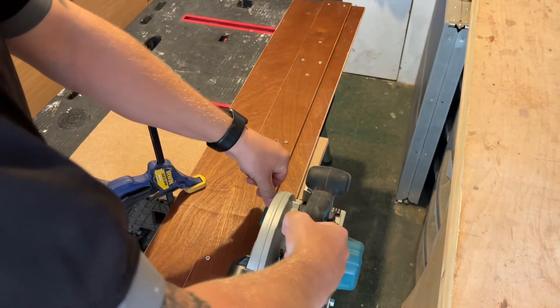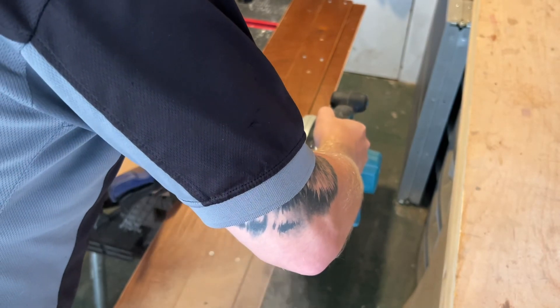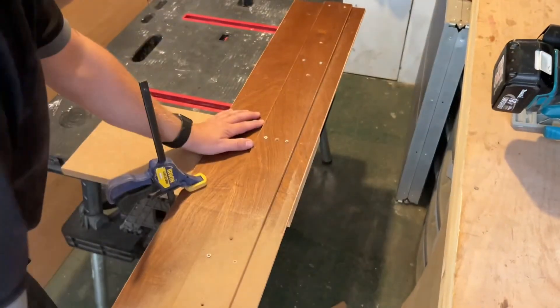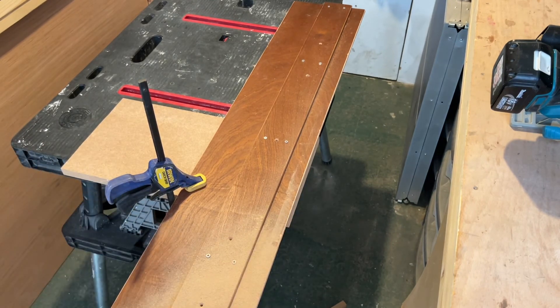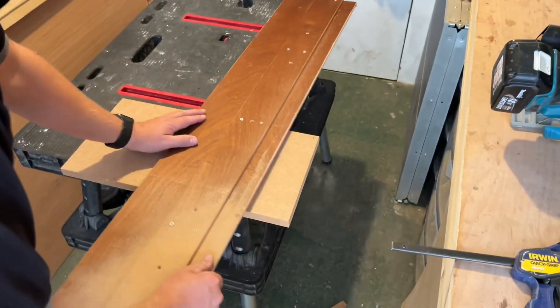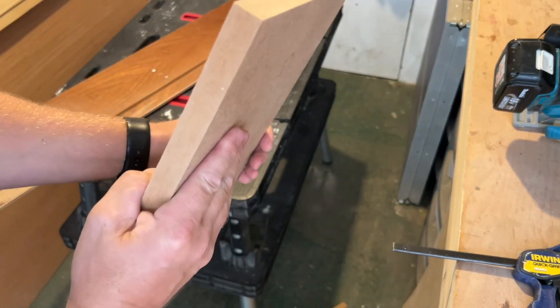Line it up. So that just cuts totally flush with this. If you are cutting boards, like I say, this edge is going to stop the melamine chipping a little bit. But if you want it perfect, have the cut so the good edge is underneath. And there we go. Hope that helps you. If you want to see more of this sort of thing, just subscribe and I'll do more just for you.